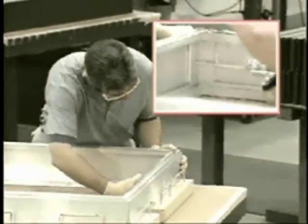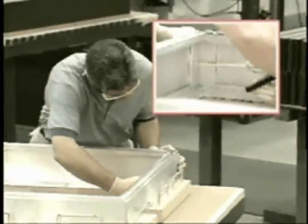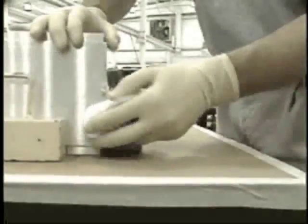Place the mixing tip into the drilled injection port and force Lord 406-19 adhesive between the corner key and the sign frame. Do this until the adhesive runs out from under the key. Inject the adhesive into all the remaining key ports. Wipe off excess adhesive on the outside and inside corners and allow the undisturbed assembly to develop handling strength for 15 to 30 minutes.